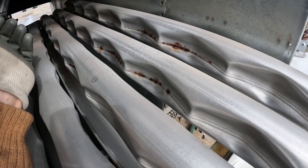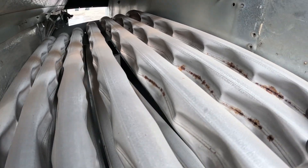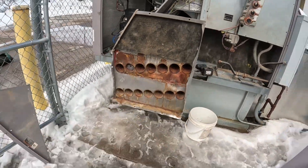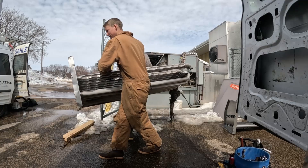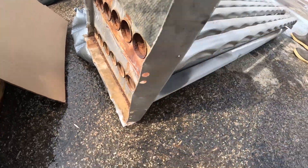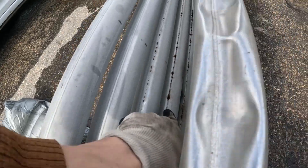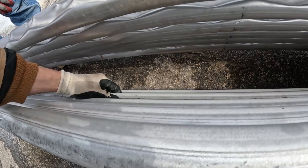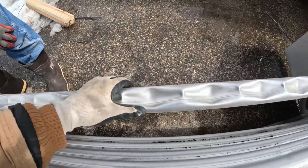So there's our old heat exchanger — you can see it's starting to rust through, which is why this one was deemed bad. This will start putting carbon monoxide into your building and combustion gases — that's a big problem. The unit was putting out just under 3,000 parts per million — about 2,800 ppm — so a lot of carbon monoxide. This new one will fix that. They always fail at the weld seams. You can see where the flame was rolling back and overheating it, and down here there's a crack — looks like a 28-inch crack. It just doesn't work well and starts to have poor airflow through it.